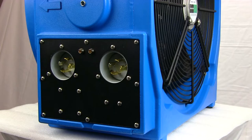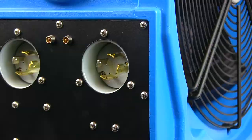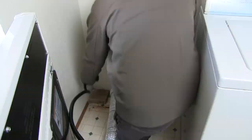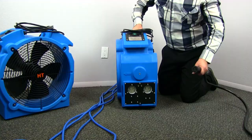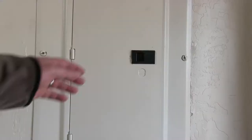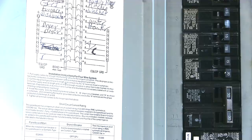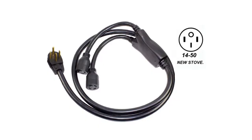The other side of the heater has two 220 or 240-volt 16-amp twist-lock inlets. 220 or 240-volt power can be found in homes and apartments with electric dryers or stoves. Electric dryers typically have a 30-amp 220 or 240-volt outlet, which can supply one of our 220 or 240-volt twist-lock inlets. From the breaker panel, you can determine how many 240-volt breakers are available and what they're being used for. Homes or apartments with electric stoves typically have a 40 or 50-amp power outlet. We supply a Y adapter in all the necessary connections so you can power both 240-volt inlets of the heater.